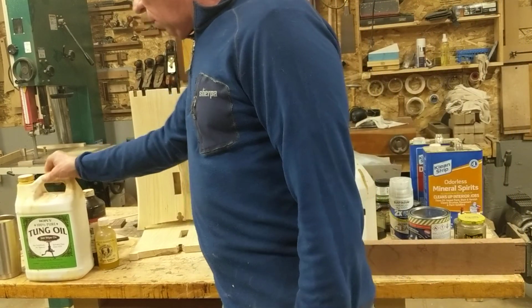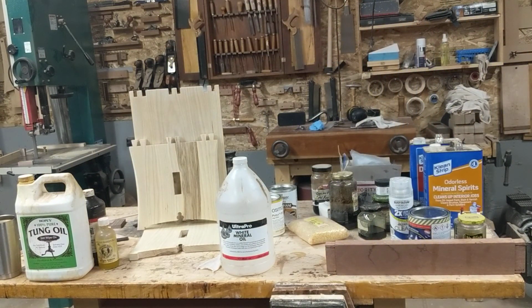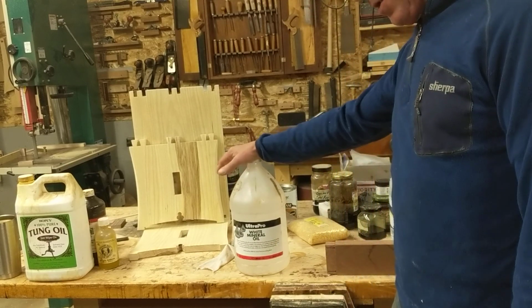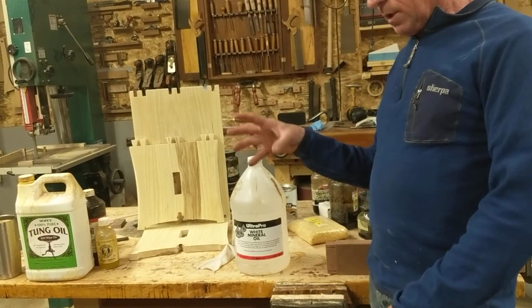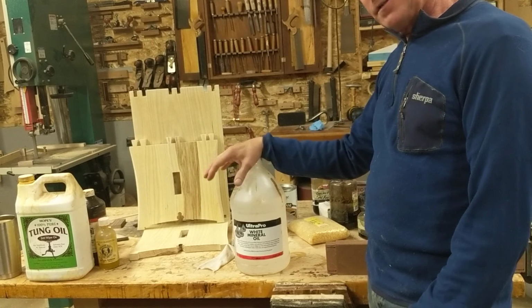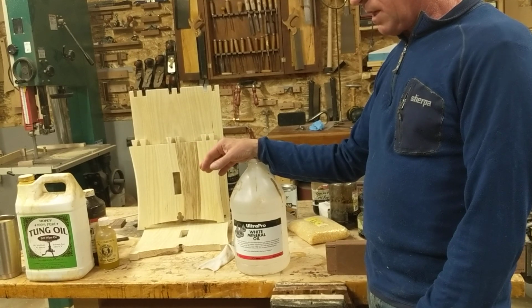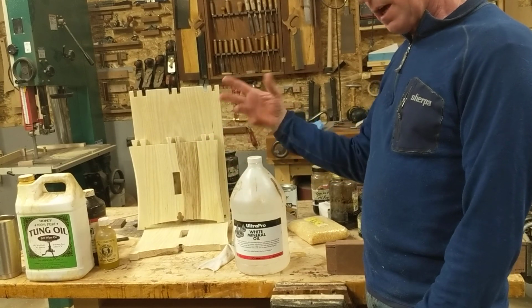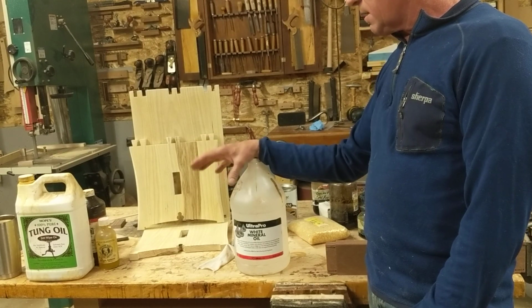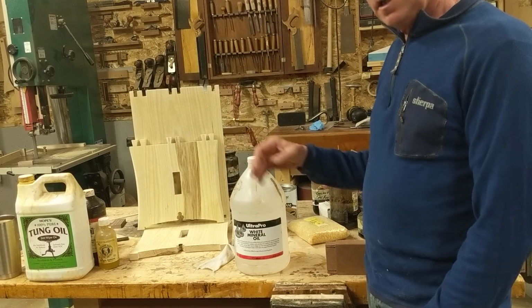Okay. Another oil that I will use on food contact things is mineral oil. So for cutting boards, charcuterie boards, sushi boards, that type of stuff, where the wood is coming into direct contact with the food, I'll typically use just a mineral oil. A walnut oil, some sort of nut oil is generally okay, not tung oil. Any of those more penetrating oils, and you have to reapply these things as that oil is worn away. So a lot of times if I send a pretty nice board out to a client, I'll include a small jar of mineral oil so they can reapply it.